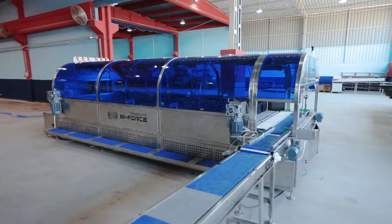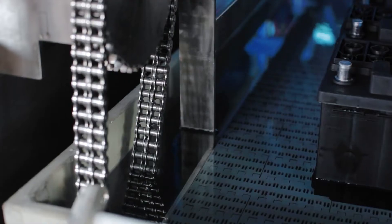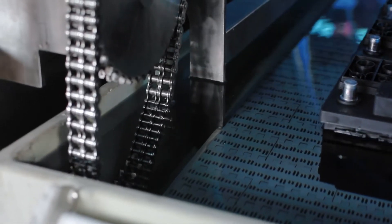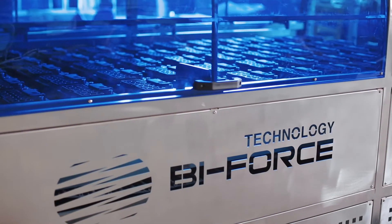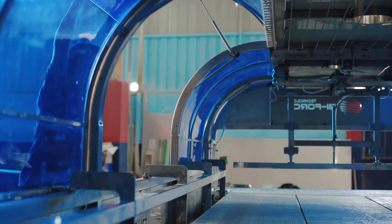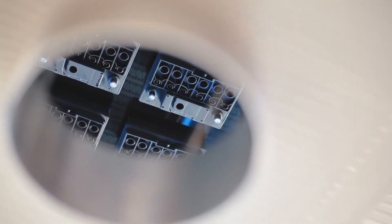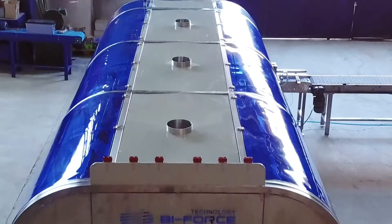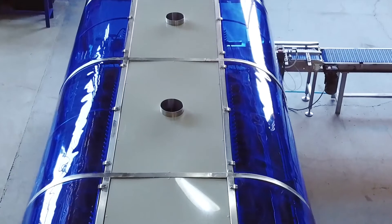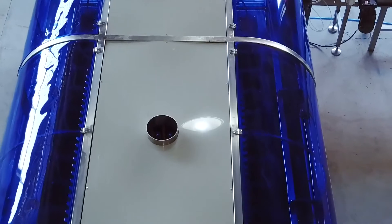The design and operation of the GT Series formation water baths eliminates the possibility of water leaks, thereby solving the urgent problem of many plants. Each formation water bath is equipped with protective covers made of acid-resistant plastic, which exclude the ingress of gases and aerosols of sulphuric acid into the premises of the workshop. The removal of gases from the water bath is ensured by an exhaust ventilation system, which is connected to the provided sleeves with the subsequent neutralisation of gases in the scrubber.